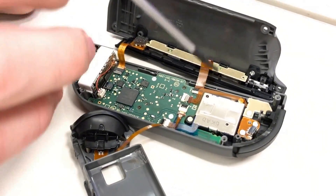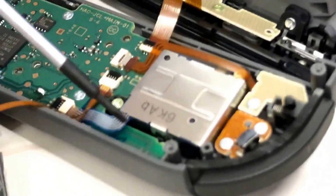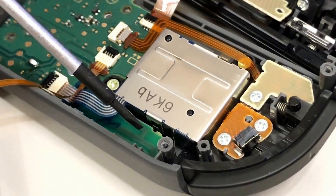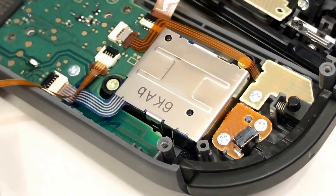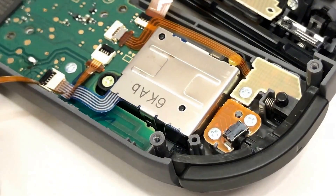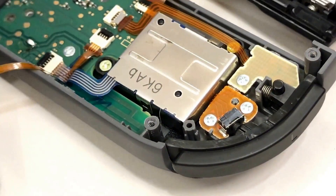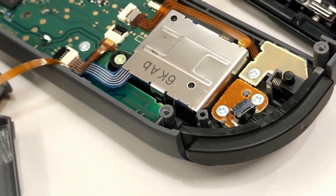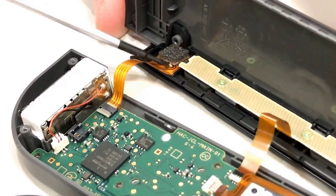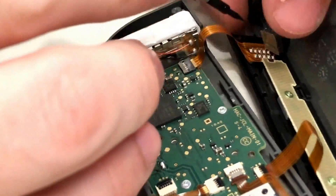Right here, you may need to go straight down to get this shot. This trace there — that little rectangular bit — is the Bluetooth antenna. It has no insulation on it and those are the ones that can be affected. If you have some conductive foam laying around you can stick it there, or you can scavenge this piece from right over here. I've removed that from several controllers now — no effect on range or anything, so that seems to be fine.